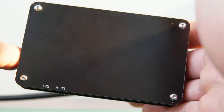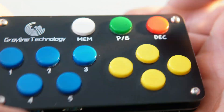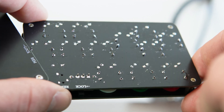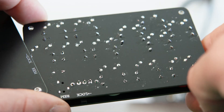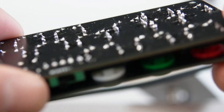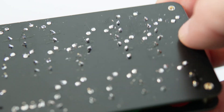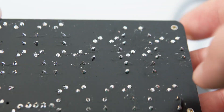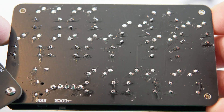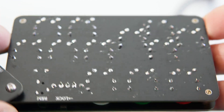I'm in the office. If I just unscrew those four Allen screws, I can see the bottom of the board and the solder traces. I kind of expected semi-poor quality from looking at it externally. I've seen worse, I've seen better. There are a couple of cold solder joints, and the solder job leaves a lot to be desired overall. Keep in mind, for $16 you could just get the kit and solder it yourself. For $20 you get quality like this — but everything seems to work, which is a good sign.